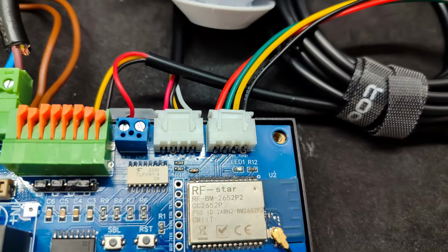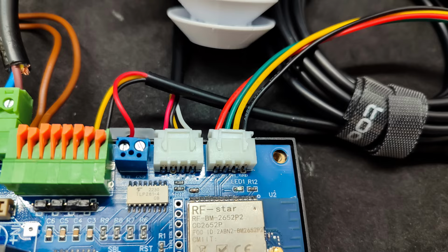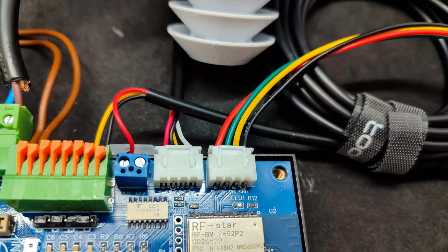The remaining two connectors are self-contained with their own power. I2C on the left and UART on the right. Various sensors of this standard can be connected to them, and the UART can also be used for firmware updates.